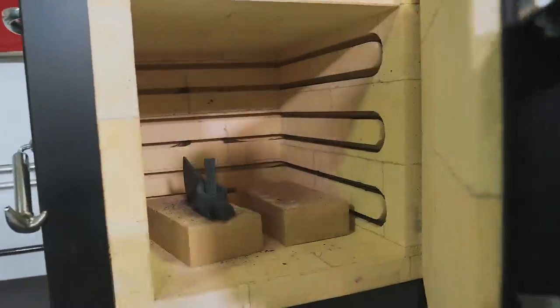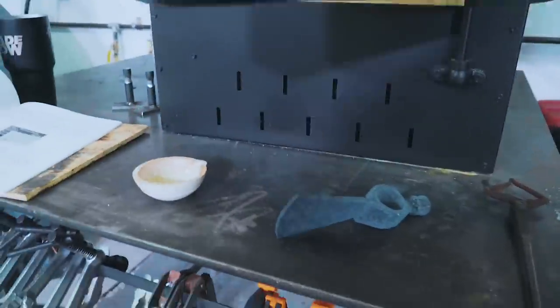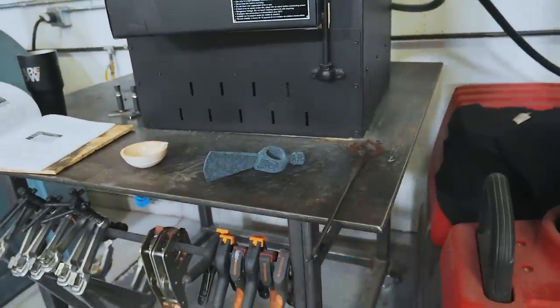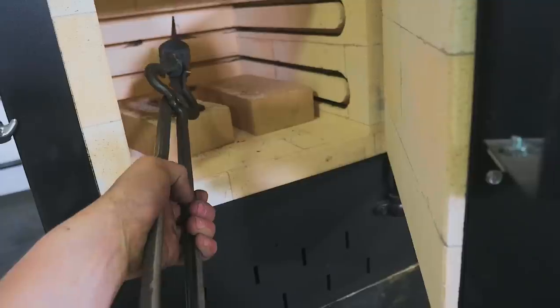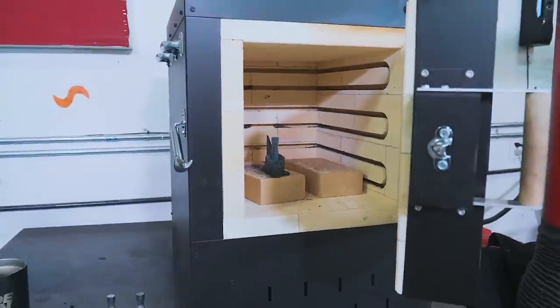So it's done in here. Time to let it cool down all the way, and then we will program this thing back up to run to 1500 degrees so that we can quench this and harden it. It's cooled down a bit now — we're going to go back into the kiln. It's going to come up to 1500 degrees and then I will take it out and quench it.